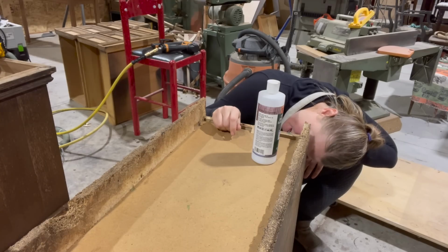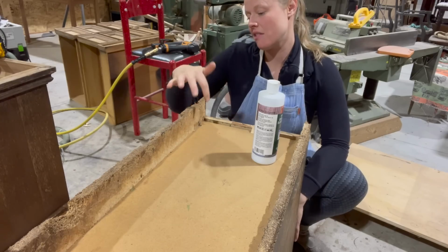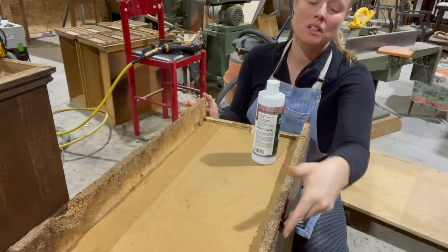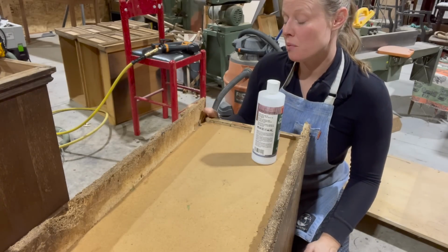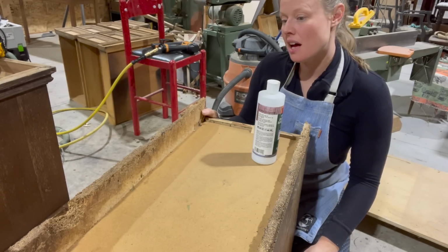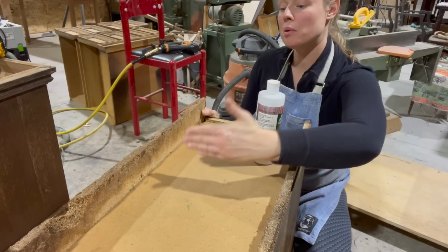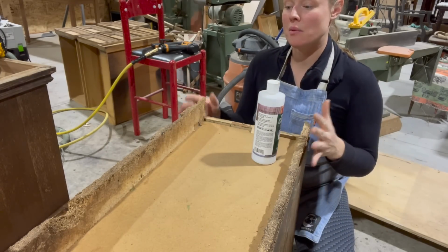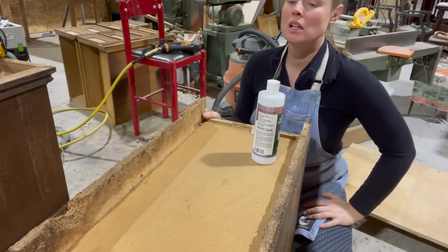And I mean, it's not great because what that's sitting on is gonna have to hang on still. The pressure point will be where this hinges, this particle board here. So we'll make it nice and thick and we'll put gliders on and we'll do everything we can to help it out. But I'll probably even put a couple of braces going across so this whole thing kind of stands together and we don't get any of the side-to-side torsion that could break these points off.